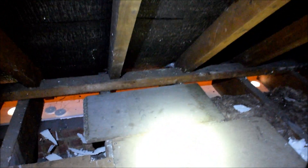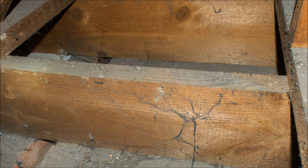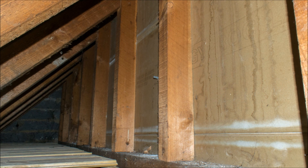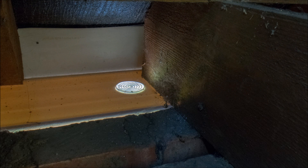It's a bit of a squeeze but let's go inside and see what we can see. When I started it looked like this with no insulation over the lounge ceiling, no insulation up against the bedroom wall, and actually a complete gap going right through the house above the lounge ceiling and below the bedroom floor. As this is a ventilated space, it was allowing a lot of cold air to blow right through the house and chill the lounge ceiling, so this really needed to be dealt with.